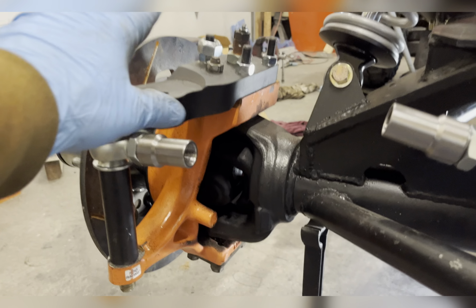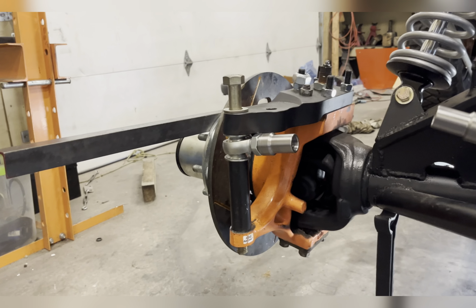I've got a high steer arm on my knuckle. Now these knuckles are a Reid knuckle, but they are based on a Chevrolet style knuckle. So they'll have the original tie rod piece here. Now what I'm doing is I'm running a piece of DOM tube here. I'm running those same eccentric washers here, running my Heim joint, another eccentric washer there. And then I go all the way through with my bolt. That's called double shear. Now, if it lines up better, I would have just put them up here, but it didn't seem to really line up any better there. So if I have a choice, I'll put it in double shear. That will increase the strength.